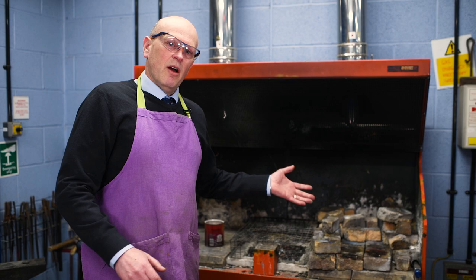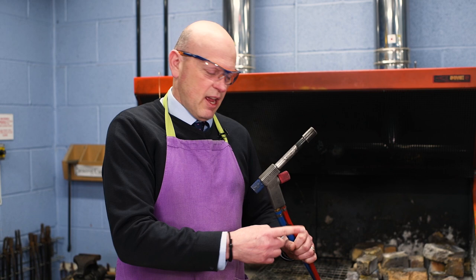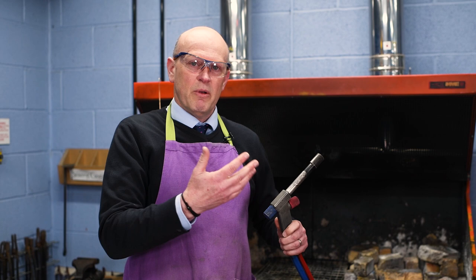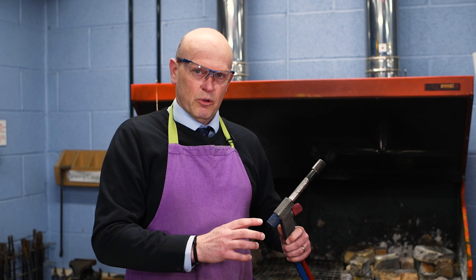The brazing torch is the part that we get our flame from. It's stored in a tube on the side, and if I remove it we can see we have two pipes running to it. The red one contains natural gas and the blue one is compressed air. The way of describing it: it is like a Bunsen burner on steroids. We get a large yellow flame if we just burn the gas, and as soon as we bring the air in we go to the blue flame that most people understand from science lessons — except this one is a little bit more powerful.